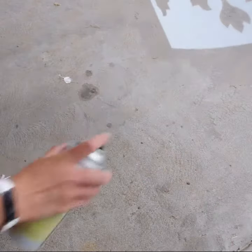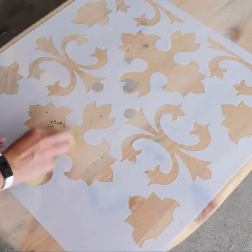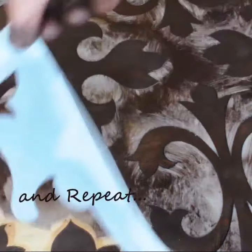Make sure to wipe your table clean, spray your adhesive to ensure no bleed through, and then we're gonna be applying our gel stain using dabbing motions. Using a gel stain gives us those nice clean crisp lines. You always want to do the darker stain first when using two different colored stains.